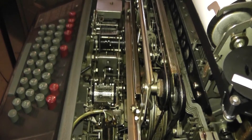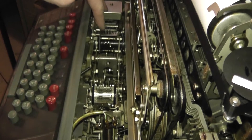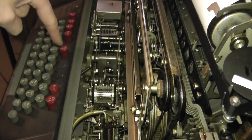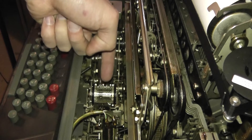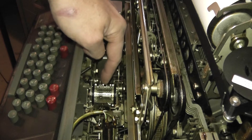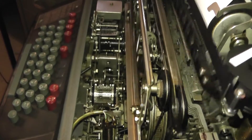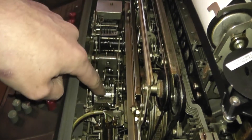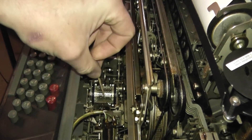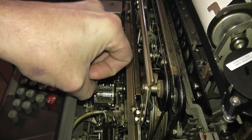Here's the same thing from a different point of view. This is the 'Here Is' mechanism — really just this wheel and some apparatus. This is the normal keyboard signaling mechanism that is used by the 'Here Is' wheel when it sends out a message. When I press the 'Here Is' button, this wheel ratchets one stop at a time past these little plates with tines. At each stop it sends the Baudot-encoded character represented by the plate, and there is a special plate that has the encoding telling it the message is over.